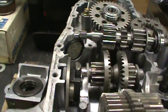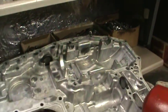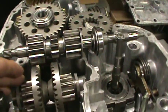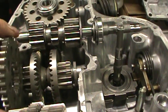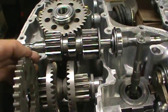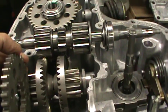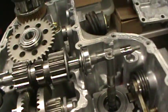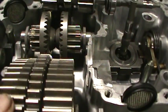We'll finish removing the silicone from the case halves and reassemble it. I don't think the damage to these two gears here is going to be a problem — now that the reduction shaft has been fixed, this gear will ride where it's supposed to, and there's plenty of good tooth surface down in there. The chipping at the ends of the teeth here shouldn't even be an issue, as well as on this ring gear.